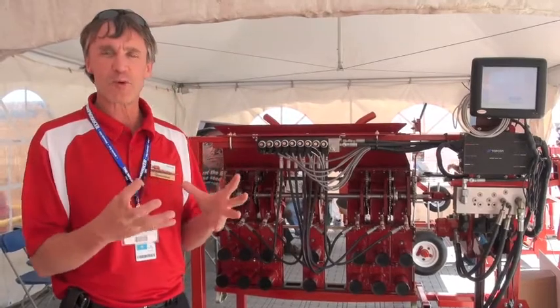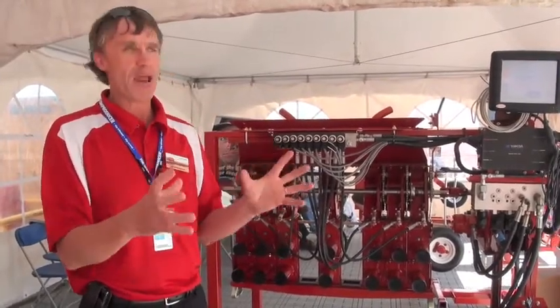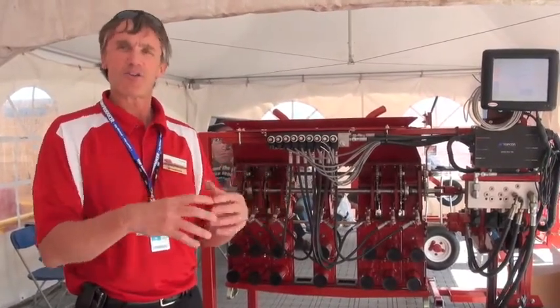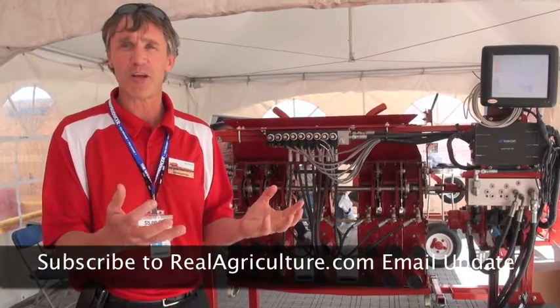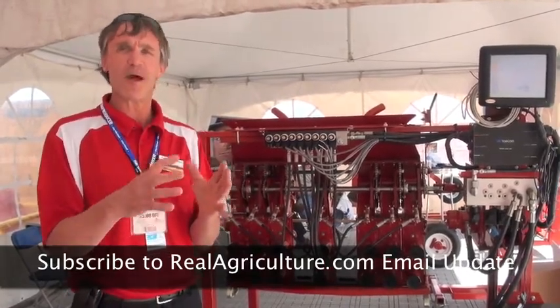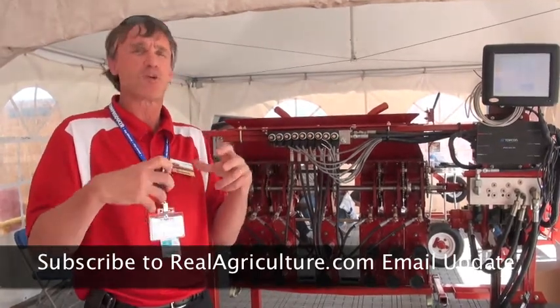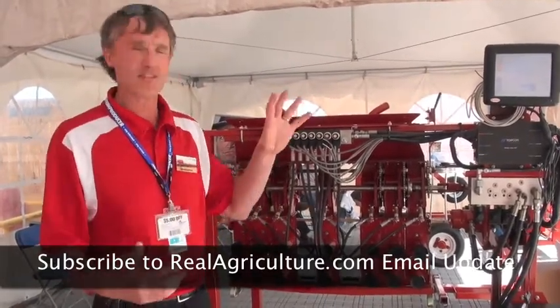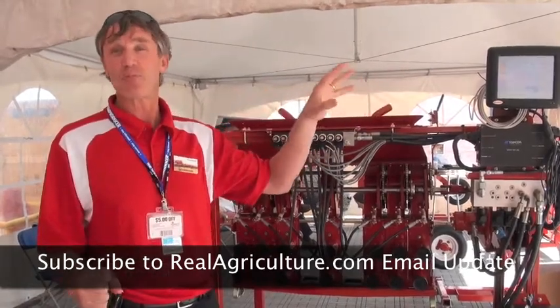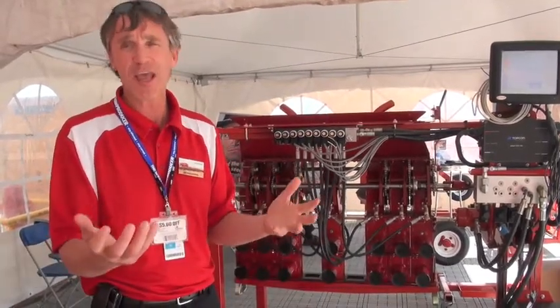We've experimented with slides on the Morris tank. You could always manually shut your tank off from your meter roller by moving slides over top of it. Our first generation was adding hydraulic cylinders to a half shutoff, and we offered that in the marketplace. There are limitations to a slide-type system though. When you put that slide over the meter roller, with products like canola where the meter roller is moving at such a slow RPM, it takes a substantial amount of time for that meter roller to clear out. You really have to time your monitor to shut off at the appropriate time so you're not still overseeding. It cleans out pretty quick with fertilizer, but you can still be overseeding in spots.